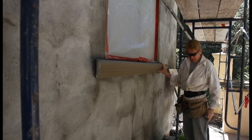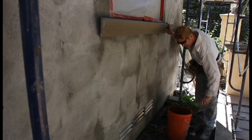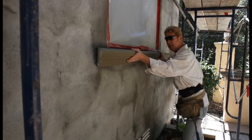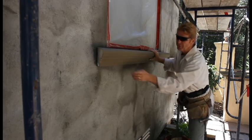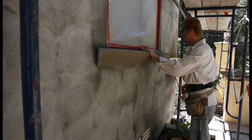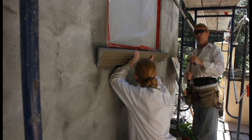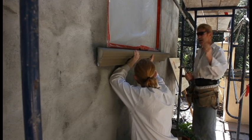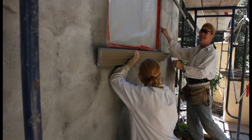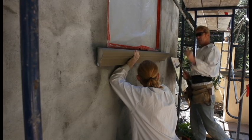Now what I've done is I've placed my bonding agent on the back of here. This bucket right here has got some poly bond — that's what I like to attach the styrofoam with. I put it on heavy and shook it a little bit, about an eighth of an inch in each direction, and held it tight. Then Jay held one side and I placed a nail here. I placed a nail because over the last few years I've had calls from folks who said a mold fell off — you can repair it, but I'll usually put a nail because you'd have to hold this for 10 to 15 minutes otherwise. We also have a weather barrier behind here — not only paper, but a membrane type of thing, a plastic that seals itself. So two nails is perfect.